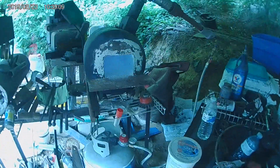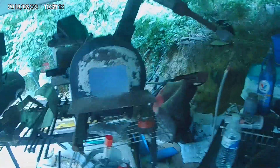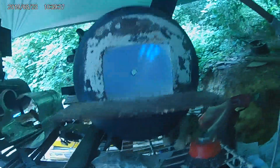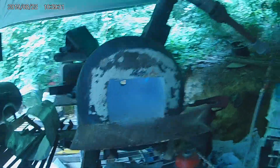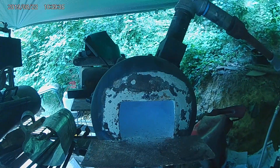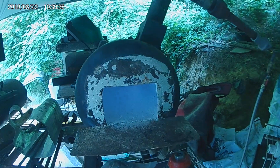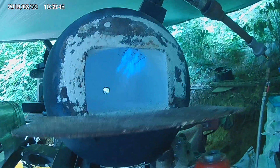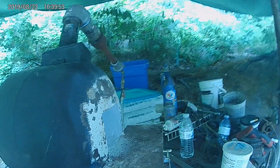The really cool thing about a naturally aspirated ribbon burner is you can make it forced air if you need it to be. If you need higher temperature, you can take a hose or something, stick it in here, and turn the fan on. But you can't really do that until you're either over 10 PSI — with the orifice that I have — or if it's already nice and hot. Other than that, I prefer the naturally aspirated over the forced air, because I'm not getting a big dragon's breath. There's no dragon's breath at all, because my orifice is so small — it's like the perfect mixture.